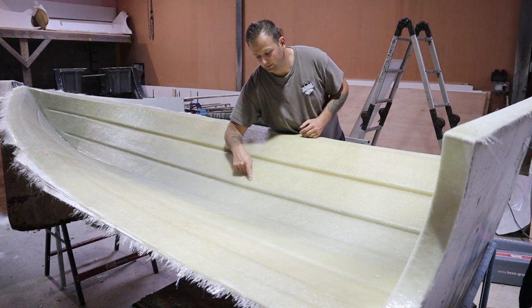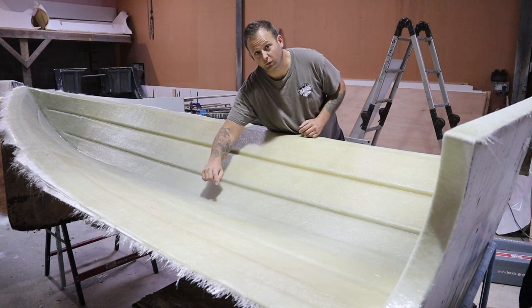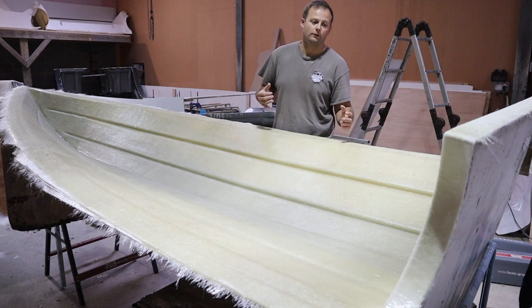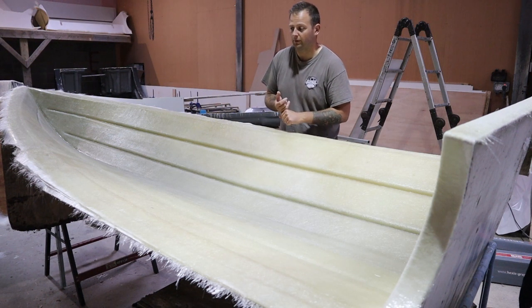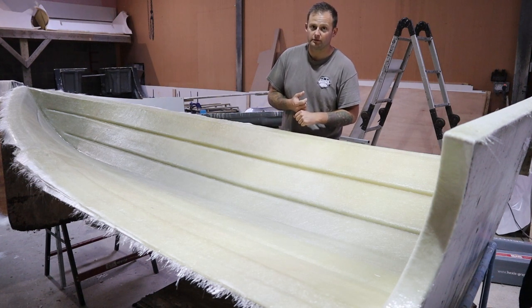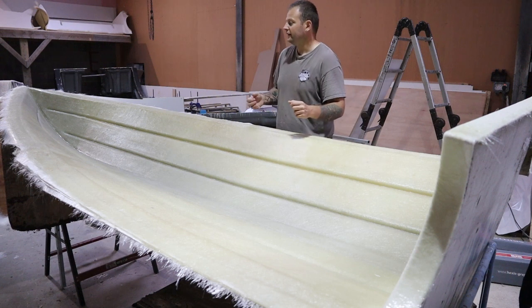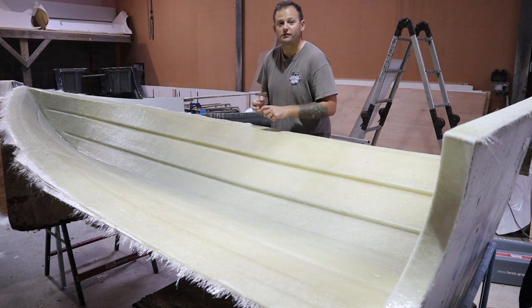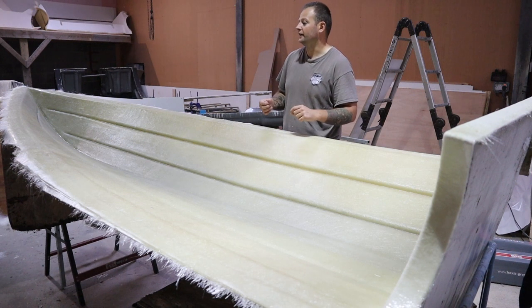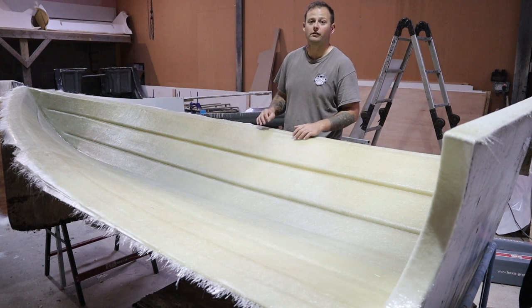So from this chine, about 2 inches up to this chine, this is twice as thick as everything else in the boat. Okay, so going back to what we said before, it's the spine of the boat. It's what's going to be run up the beach when you're taking your missus and your kids out. It's the thing that's going to be smashing into the waves. It's the thing that may be hitting the rocks, the stones, or anything else that's coming in, depending if you're checking out the totty on the beach and you're not quite looking where you're going.